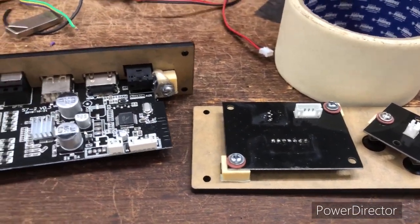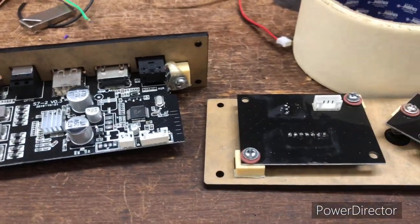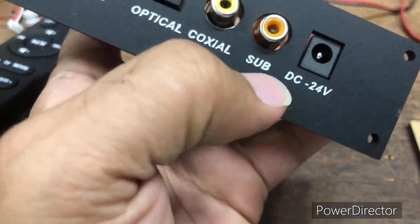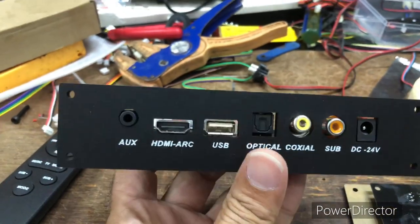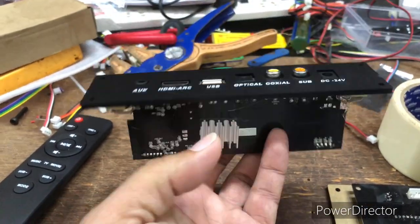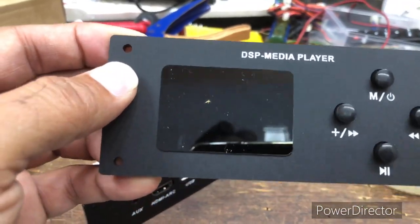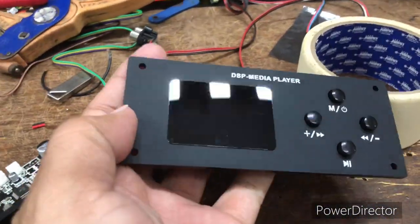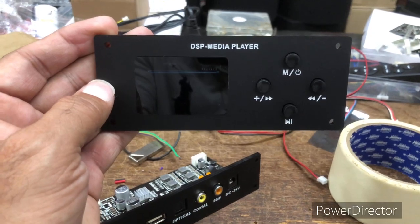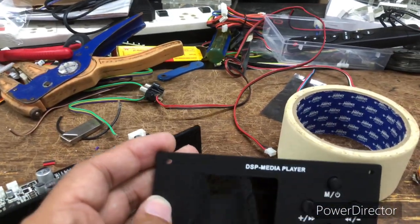You can connect two speakers directly — 30 watts each at 4 ohms. Class D amplifiers work with 4-ohm speakers. For the subwoofer, you can use a 6.5-inch subwoofer at 4 ohms for very good bass. The back panel is included in this kit — you can fix it on a bass tube or amplifier enclosure. The front display unit also has four holes for easy mounting on a wooden or metal cabinet for a 2.1 soundbar build.